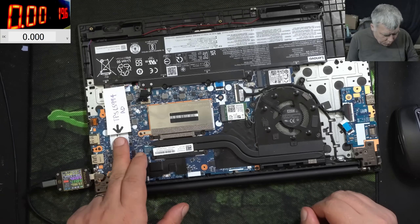The solder bridge is done. Now if we plug the charger — we have 19 volts. From the gate to the source we have like 1.4 volts. I'm pretty sure people who know the schematics thought that if they resolder that MOSFET back they'd have the right voltage on the gate — which is wrong. This chip has an issue from the factory. Here there is no load on that chip, that chip is not getting hot. The chip is actually driving the MOSFETs, so it's doing basically no heavy work, no current handling.